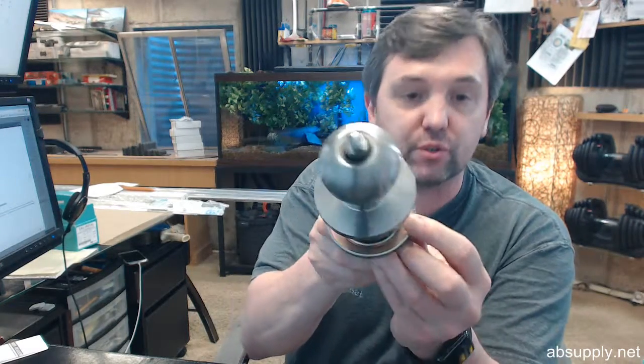They're exit device trims, they're lever locks, they're deadbolts. None of it causes a fit when you're considering installing it or rekeying it. The outer escutcheon features the prongs that will go into the semicircles of a 161 prep in a metal door that would occur at 3 and 9 o'clock, or in a wood door, they would just bite down into the face of the door. And that just helps prevent the chassis from spinning through use of that rotational force always being put on it. Installation instructions are included with the lock, and there's a link below here as well to them.